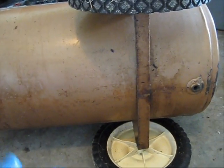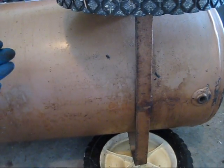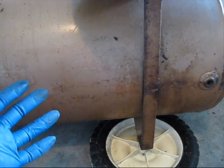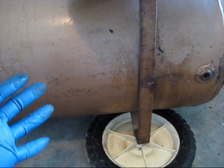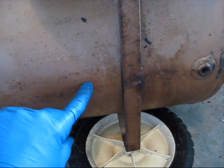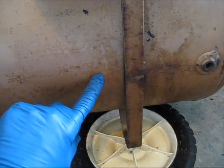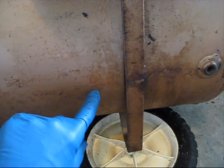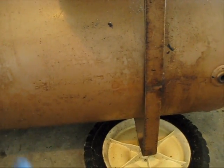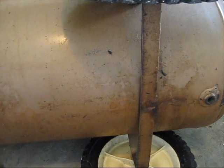That's very, very dangerous, because what that means is the entire integrity of this tank has been compromised. When you're dealing with a pressure vessel, usually what happens is they fail structurally in one area and then sort of unwrap very quickly — it's a lot like a balloon popping, except instead of popping, it explodes. I'm not exaggerating. If you go on the internet and look it up, people have been severely injured or killed by compressors exploding. When you're dealing with rust on a compressor tank, it's like an iceberg — you only see a pinhole, but by the time you see it, the entire area has already been compromised. If I had let this get up to full pressure, it could have very well exploded.